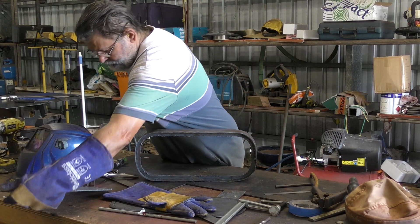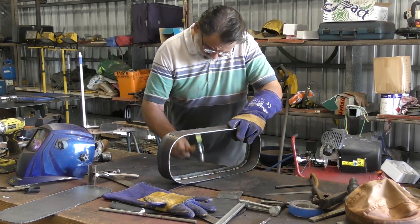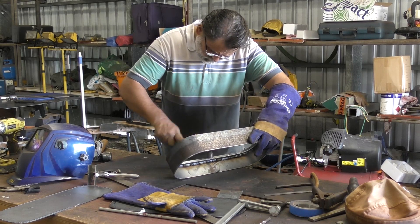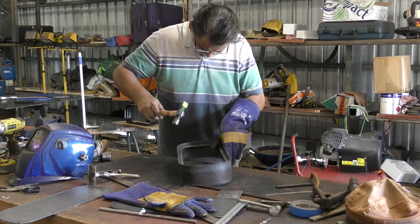What I use to cut the outline of the seal rings from a piece of plate is my small handy plasma cutter. One of the products of using the plasma cutter is you do get a bit of dross left on the outer edge after you've cut.